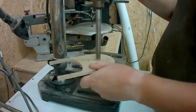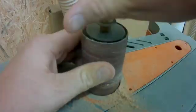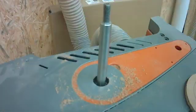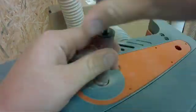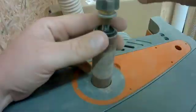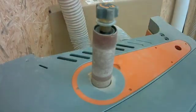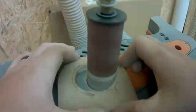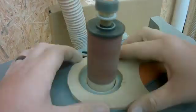I do this by starting out with a five-sixteenths inch bit on my drill press, then moving over to my spindle sander and gradually increasing the size of the spindle as my workpiece allows. As I get to the bigger drums and spindles, you have to be careful and just barely sneak up on the line — just barely kiss that line. You don't want to make it too big, otherwise your port will be loose and it defeats the purpose.